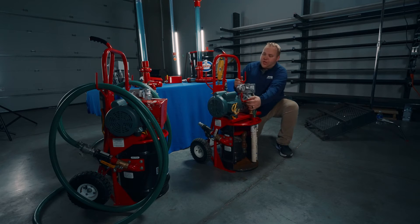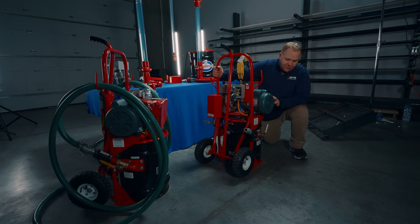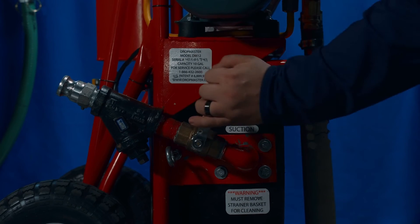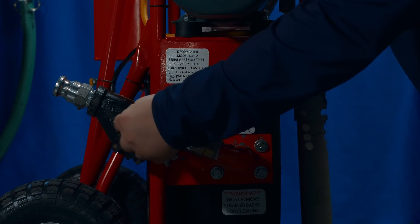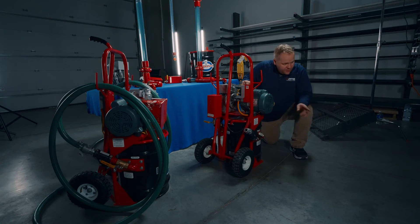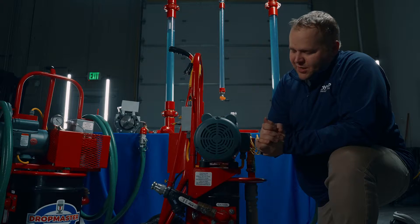One more thing on poor suction: going back to when I close the ball valve — if the issue is not with the DM-12, you may have a leak in your system. The other scenario is you may have a gauge reading 10 with the valve open or closed, but poor suction at the sprinkler. That can be a blockage in the line, and your most common culprit is the Y strainer being clogged. If it's clogged right there, the vacuum will read 10 on the gauge, but there's no vacuum after the Y strainer. Even if your vacuum gauge reads 10, if at the sprinkler you're getting some water, check your Y strainer.